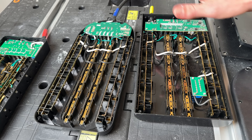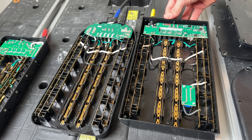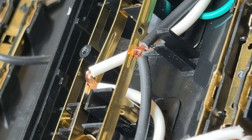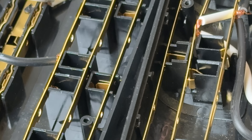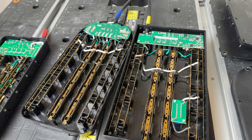For blue and yellow, overall they look pretty similar to each other. At least they're using white for the neutrals, opposed to green like we saw last time. But if we look close at the solder joints, those look really lightweight. With this many outlets and bringing through this many amps, you would think you'd want a little better connection. So now let's see if the shoddy design translates — if those breakers trip where we expect them to and how much heat is being generated.